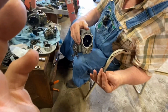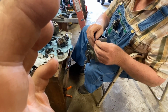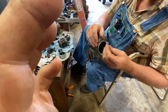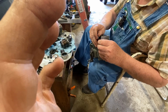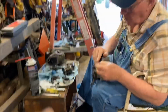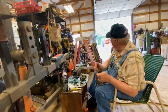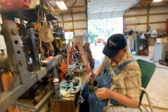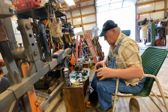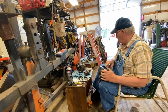This wire was not going through anything. The seal appears to be still there. The only thing that wire went through was this bolt. It did not come over here and go through these. It looks like someone took the wire, ran it back through there, and just twisted it. Anyway, that's one thing that makes me believe that somebody has tampered with it. The top cover on the governor housing wasn't sealed with a lead seal.